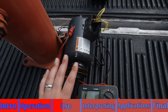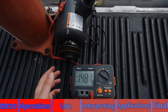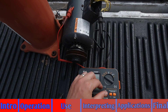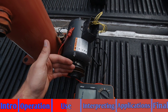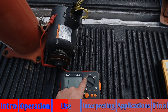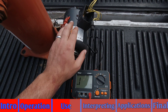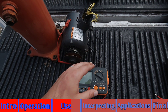Coming over here to this smaller blower motor, we've got the leads hooked up and I've got a ground point — let's see what it reads. You're going to see as soon as it comes in it's just an immediate spike up. That was a very stark contrast to what the compressor had done. That means we went above the rating for this Megger, and I was reading that at 1,000 volts output. That gives me a 2 billion ohm range, meaning that this motor megged at above 2 billion ohms at 1,000 volts DC.